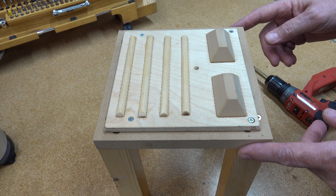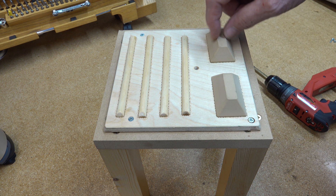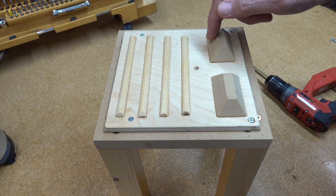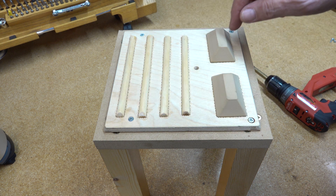This is about 8 inches square, this is about 7, and I have good draft on everything. Draft has the ability to be removed - lots of angle. Because this is half of a dowel, excellent draft. Even the ends have draft.